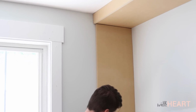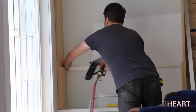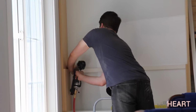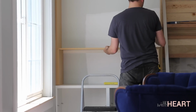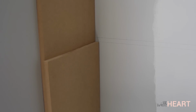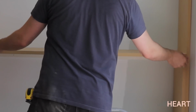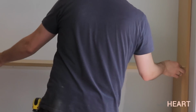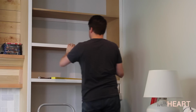against the outside walls. Now the key to strong shelves is placing the end of the shelves on 3/4-inch side pieces. We also added a small 1.5-inch strip along the back of the wall to support the shelf lengthwise. The shelves end up resting on smaller 3/4-inch side panel pieces cut to fit between the shelves. The shelves themselves are also 3/4-inch pieces of the same MDF material we used for the side panels.